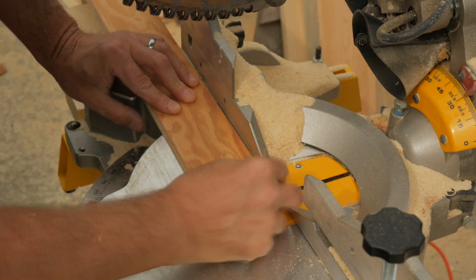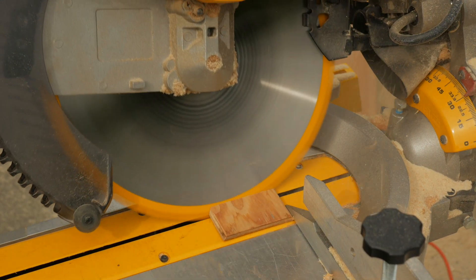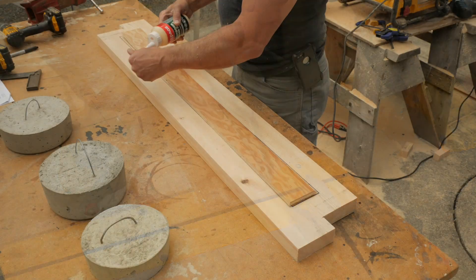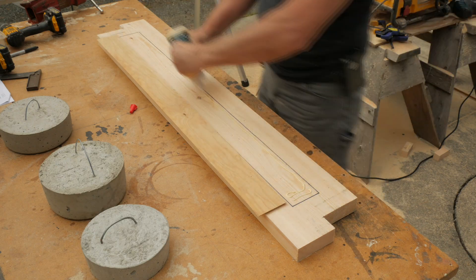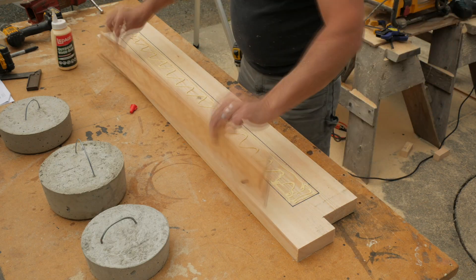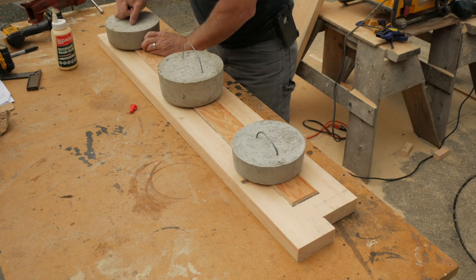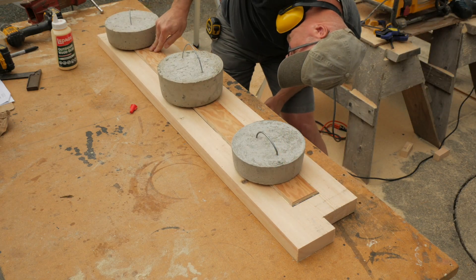You could personalize your panels here by adding an oval, circles, a logo, or anything you want. Just be sure that whatever you use has a beveled edge so you can remove the panels from the base after casting. I attach the inset with glue and weigh it down until the glue dries. If you use short screws instead of glue, you can change the inset design in future castings.